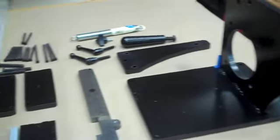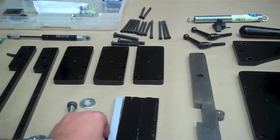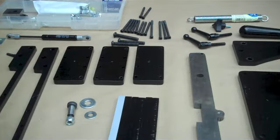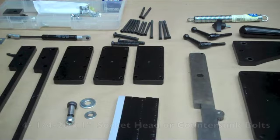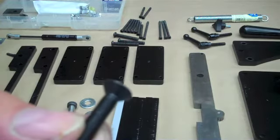And then this is the rest of the parts. I've got most of these painted and ready to go. We'll go through all these parts. There is some stuff that isn't finished yet — we still have a little fab work to do on the idler arm and on one of these spacers here. That's why it's not painted. It has to do with adding a gas shock system to the idler arm for our tensioner. I'm going to start with, obviously, the base plate. That used four one-inch quarter-twenty socket cap screws similar to these, but like I said in the other video, you can use countersink screws as well.